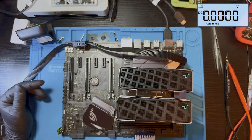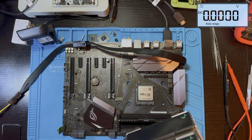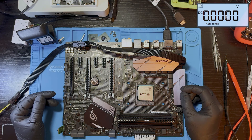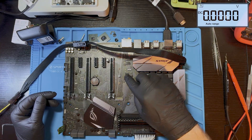At this point, it's starting to look like it could be a BIOS or firmware related issue, or perhaps something wrong in the CPU power communication path. Time to take a closer look under the microscope, especially around the CPU socket area to see if anything is damaged or missing. Let's move to the microscope.